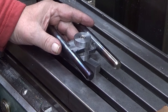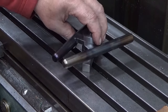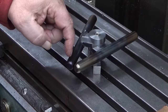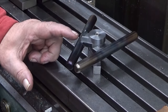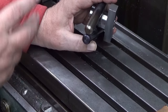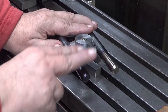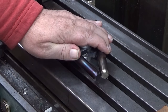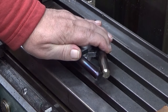I'm thinking about how to do this. Of course, I have in my picture the rolls, where there is a slot and a hole, and it's milled under so that you can use the knurling wheel. In order for them to become aligned with each other, it might be a good idea to have these two pieces together and first make a small slot here, which you can then use to align the rest of the slot.